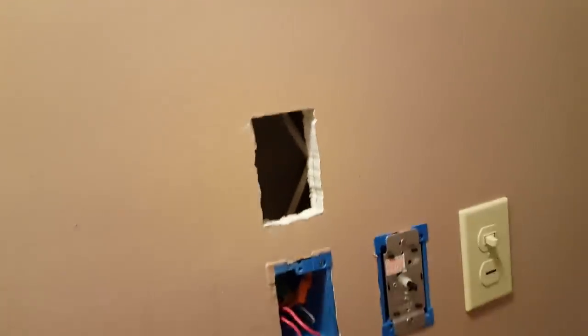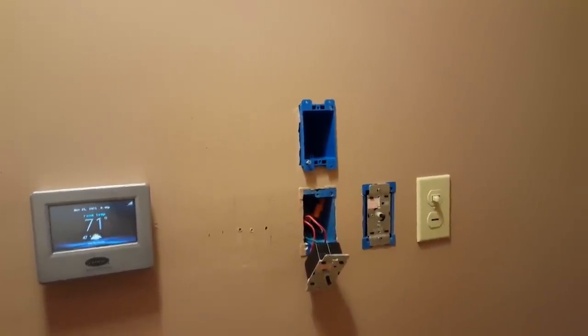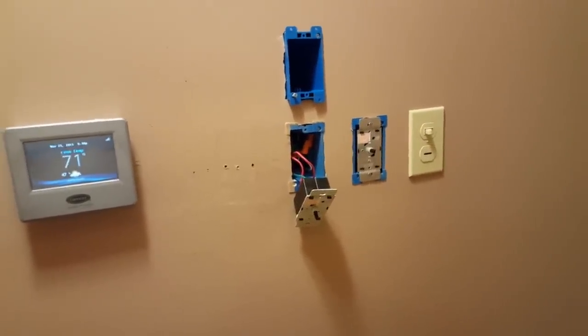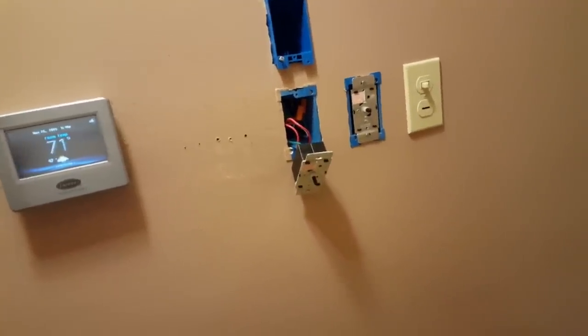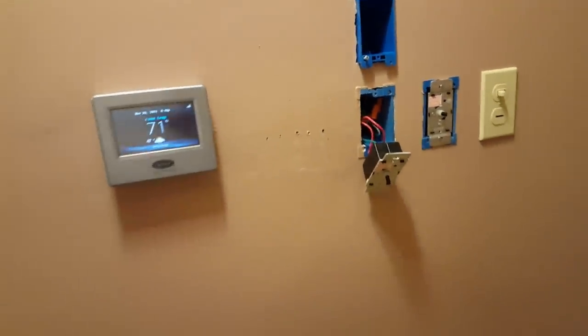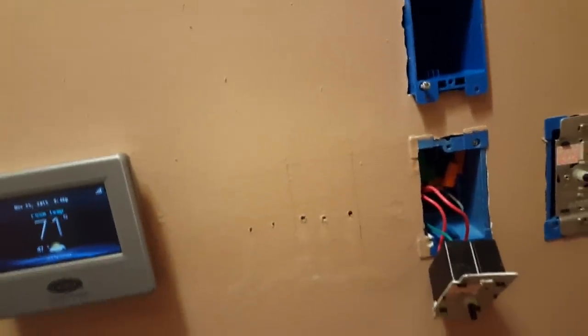This will work just fine. I'm going to put it right above the speed control on-off switch for the fan itself. This is also going to save me, because the studs are right here, so the only way I could get power back down — the easiest way without ripping everything back up — is the junction box for the fan itself right across from me. I was just going to run a 14-2 wire back down here: power comes down and through the switched thermostat, power comes back.